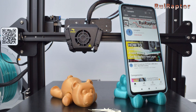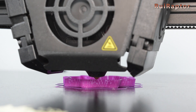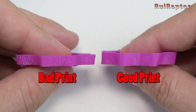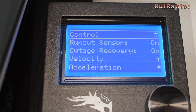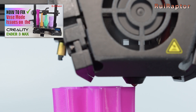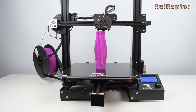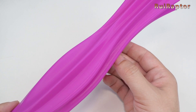These articulated models also can be used as phone holders and they ended up very nice. However, when printing the vase, which was sliced in vase mode, we were not able to print it successfully. Instead of moving continuously, the printer was constantly stopping and going, leaving marks on the print. After troubleshooting, we concluded that the print resume feature was interfering with vase mode prints. Once we disabled the power resume, the printer started to print the vase as expected. In our channel, you can find a video dedicated to this problem explaining it in detail and several ways to fix it. The tall vase was also used to check for any Z-axis issues — as you can see, it didn't have any issues along the Z.